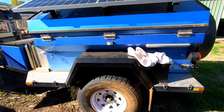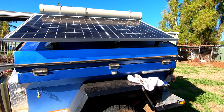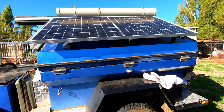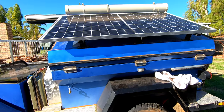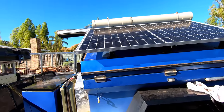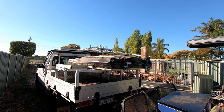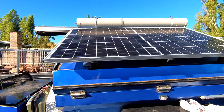With a camper trailer we've only got one solar panel and it's facing one way, and you might get shade on it. Then split cells are the only way to go. Same as a caravan - if you've got an air conditioner sitting on the roof of your caravan, and as the sun moves the shade of that air conditioner moves, split cells would be the best for that. If you've got a shaded roof and you've got a chimney, or a satellite dish, or a tree that is moving across your panels during the day, then these panels would be well and truly worth putting up there.